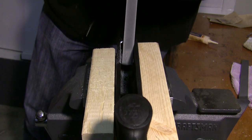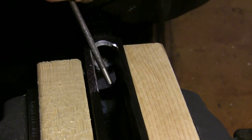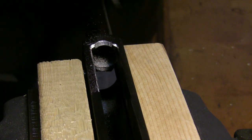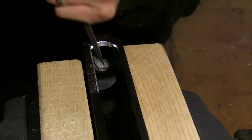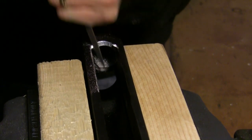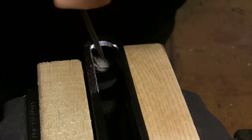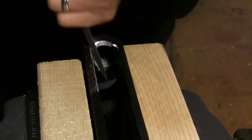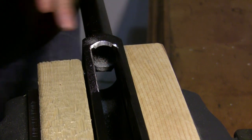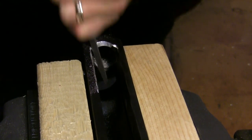As far as the angle I'm going, I'm going at about a 45-degree angle coming down. I wanted to get a pretty good rough edge there and then at the very end go back and fine-tune and bevel it out. I actually kind of stumbled onto this triangular file — it's very small, probably about six inches long. But once I found it and figured out how good it was for this, I pretty much finished the job with it. I could get it into the corners and rounded off all the edges just perfectly. Between the round file and this little triangular-shaped file, this really allowed me to put the edge on the aluminum frame that I wanted.